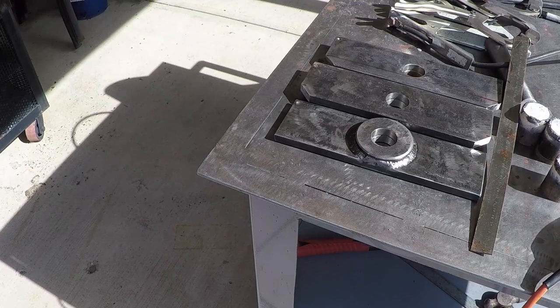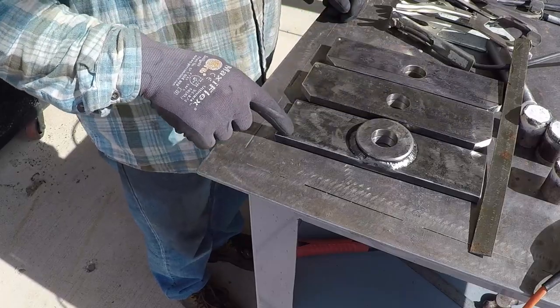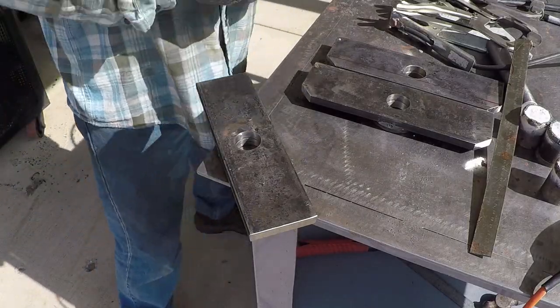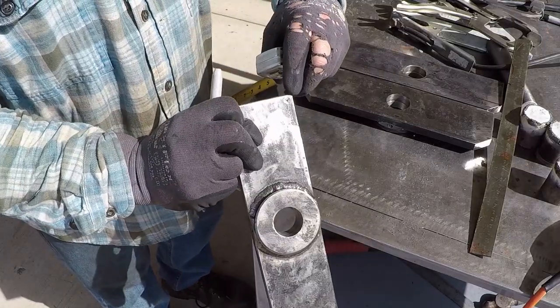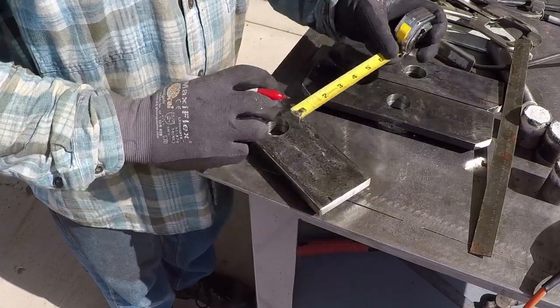The main or middle shaft support brackets are going to be below the bed support channels. I made sure the brackets are positioned to the top, and I gusseted the bottom corner of each bracket. I always like to round or cut at 45 degrees the end of any exposed corner to make it safer, in case someone hits their body on it, so it doesn't hurt as bad.